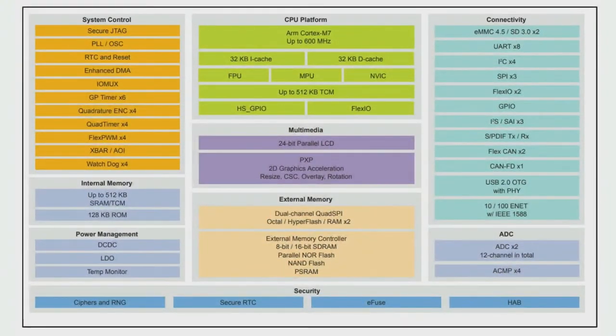There are lots of peripherals — I'm not going to go through all of them: SDIO, eight UARTs, four I2Cs, three SPIs, FlexIO, which is quite interesting. If you've used PIO on the RP2040, FlexIO is kind of similar — it's an all-in-one way to do other protocols that might not be natively supported. Lots of I2S. The 1011 series doesn't have CAN or Ethernet, but the 1040 does. It has one USB high-speed port, which can be either peripheral or host controller. Some 1050 and above have two USBs. There's a parallel LCD — enough GPIO to control 24-bit displays with 24-bit RGB, V-Sync, H-Sync, dot-clock, et cetera. ADC, no DAC, but there is I2S output and lots of PWMs and timers.